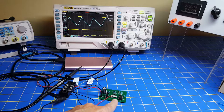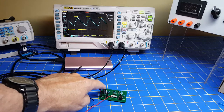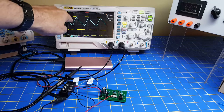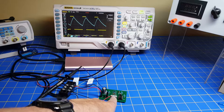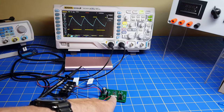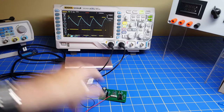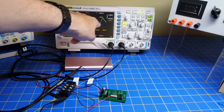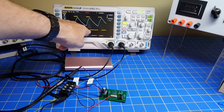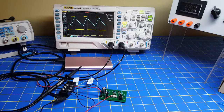Here I've taken my pulsar circuit and I'm measuring two values. I'm measuring the voltage across the capacitor — that's in blue — and the voltage across the output resistor, which indicates current flowing to pulse the battery, shown in yellow. You can see it pulses on. I'm in roll mode because it's a slow process. It's on for five seconds and off for about 15.